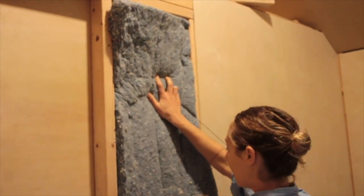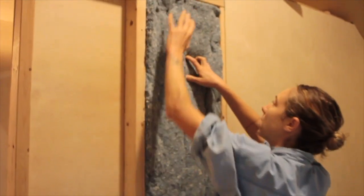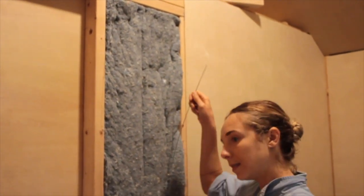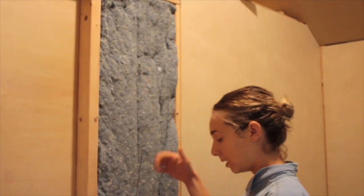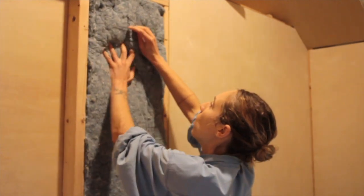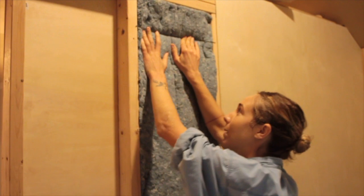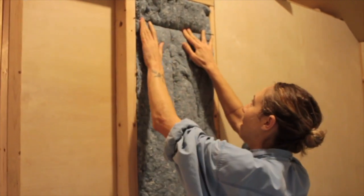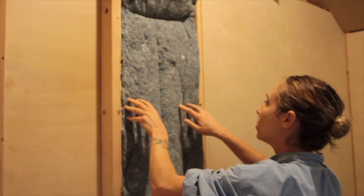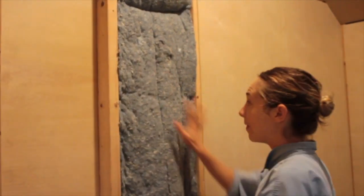With extra material I've made a dog bed, and I'm planning on making pillows. You can make little roll-up mattresses and stuff because it's just cotton denim material. It stays nicely in there, but what you don't want is for it to slide in the wall, especially if you're moving — it might tend to go down and then all your insulation will get squished and won't be doing what you need. So you just take these little supports — as you can see they're a little bit wider — and safety first, wear goggles. These can pop out and poke you in the eye and you don't want that. So you just push this in into these corners and it stays; it gets stuck in the wood. You can do them about 12 inches apart, or however you feel you need, and then just work your way all the way down, then go to the next section.